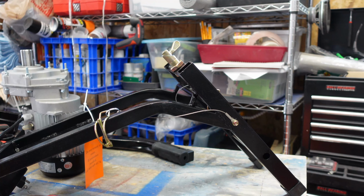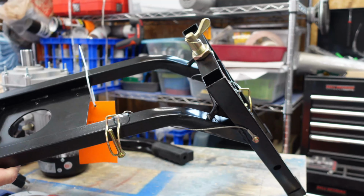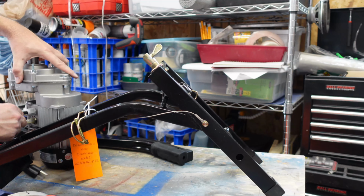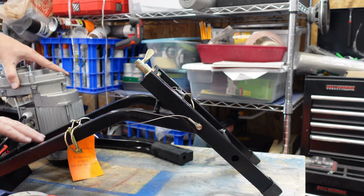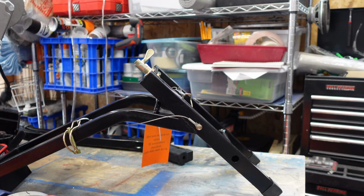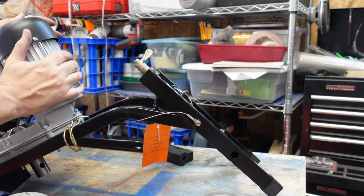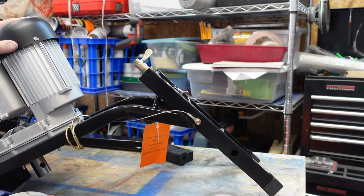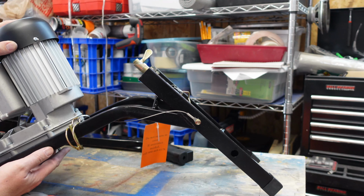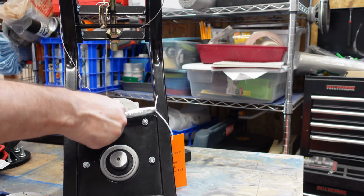Install gear motor on the tilting main frame, and it shows the picture. That's this L-shaped kind of bracket. So here, there's 4 holes in this plate, and the motor orients this direction. And then we're going to reinstall the flat washer, spring washer, and nuts that we pulled off of that motor a little bit earlier. Tighten those to 10 pounds.